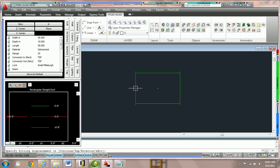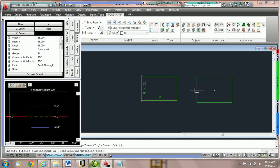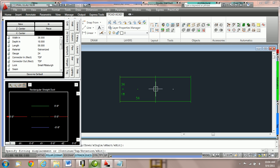If I would like to hold it by the center center out, I can switch it to out one. Notice the duct hasn't changed orientation — I am just holding it by a different point. It is important to understand that in Practicad we always connect out joints to in joints and in joints to out joints. This maintains good duct line integrity, and there are many advanced tutorials on maintaining duct line integrity. Here we're going to switch it back to in and place the duct on the drawing. You will always know if the connectivity is good because Practicad will usually resize the duct to fit.